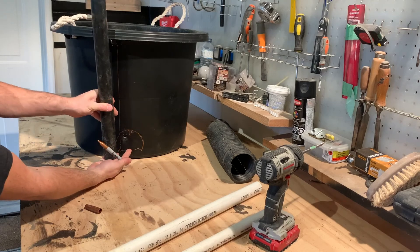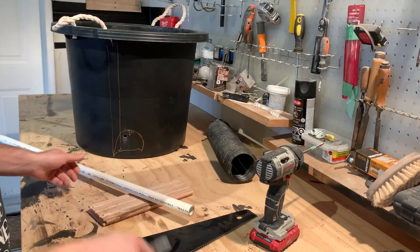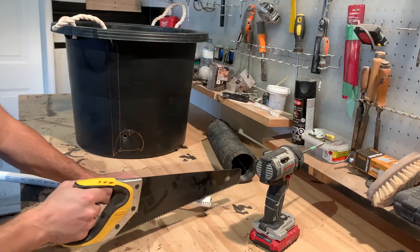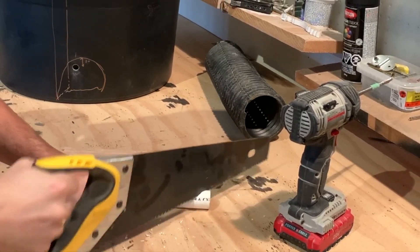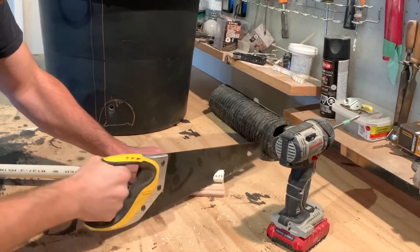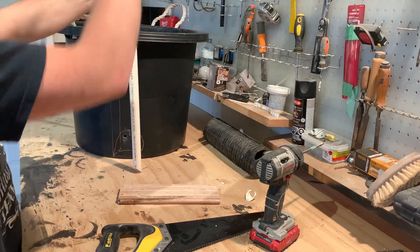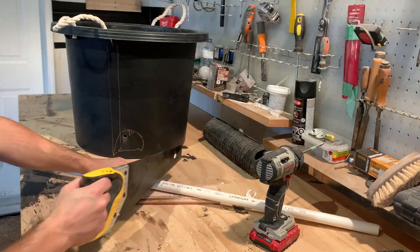If it was sitting flat, your water would not have a chance to flow up freely. The best way to cut these plastic pipes is to make your mark — the 45 doesn't have to be accurate as long as it's sitting an inch or two above your tub. Mark it and use a saw to cut it on the 45; just be careful because they are rather sharp. Then you can mark your height and do the same thing on the other side.